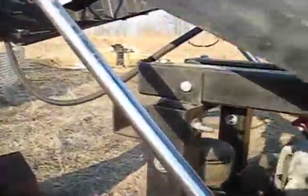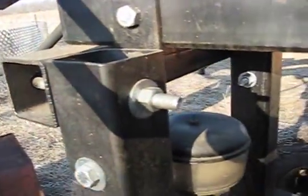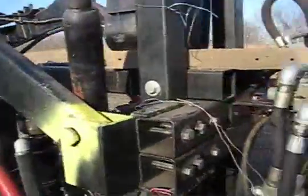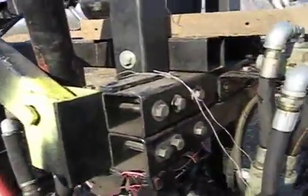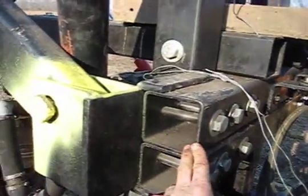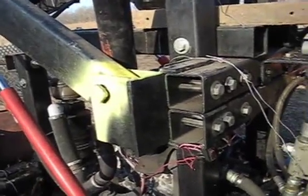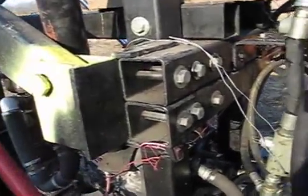The frame is largely a bolt-together design. You've got XYZ kind of bolt corners — it's really just a box with wheels right now, and upon that you've got the loader arms connected. The structural members here are all four by four by quarter inch tubing, and there's actually a little cheat.